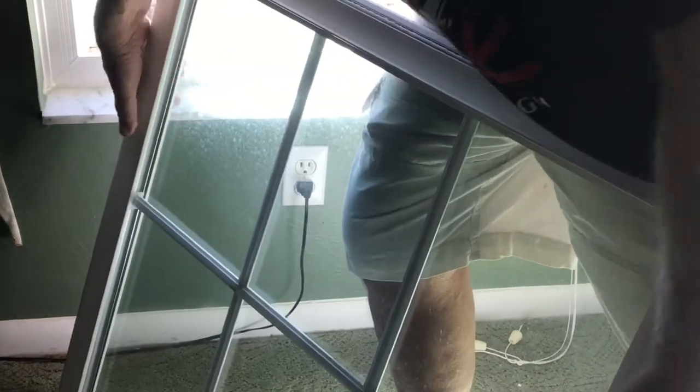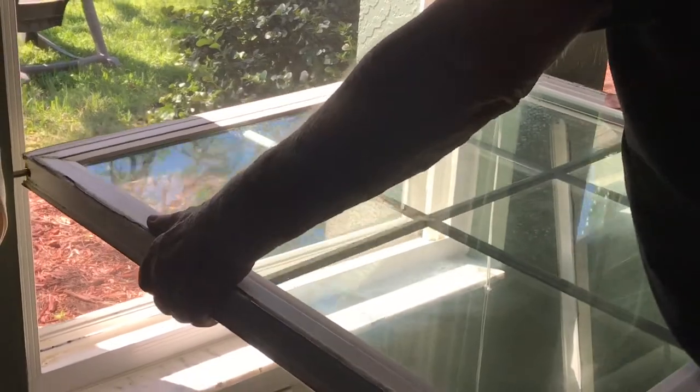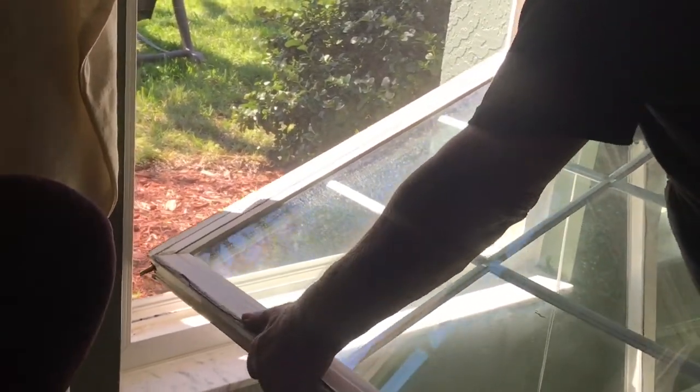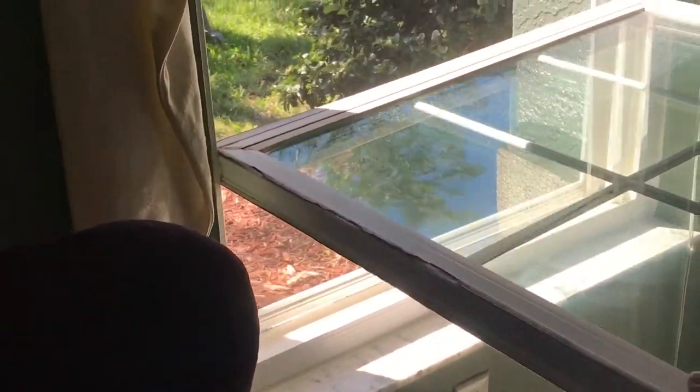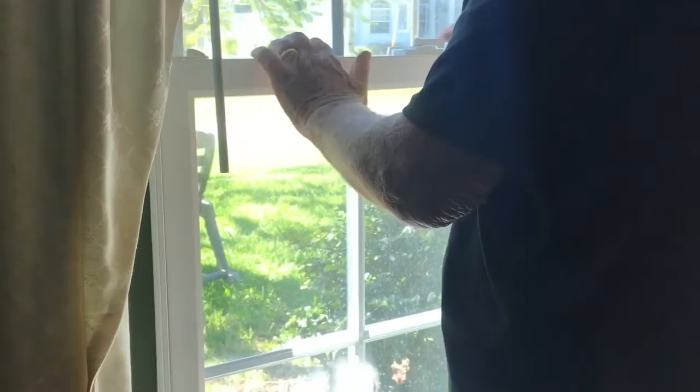This is going to go back in — the box shoes — that's what has the spring in it that helps your window go up and down and tilt in and out. You've got to have them uneven like this to get them in and out — you can't have them even or they won't come out. When you take them out, you tip the window so one shoe is lower than the other. Put the bottom one in, then come down, line up the top one, pull the bottom one up a little, raise the window, and just like that, good as new.